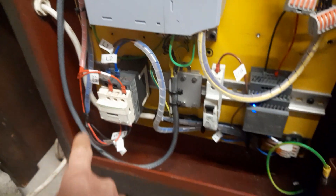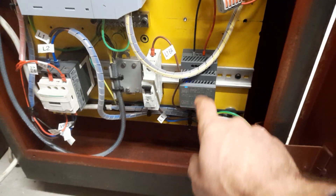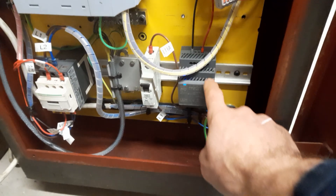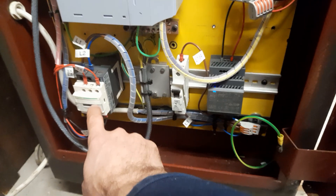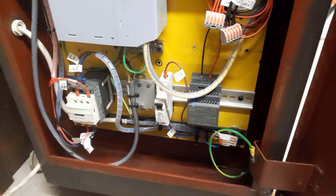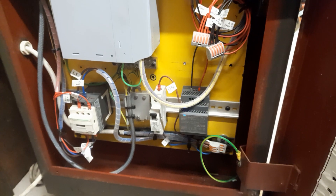The power just comes from a standard 13-amp plug — I've never blown the fuse. That power comes in on the white cable. I split that power because I've got a 24-volt power supply, and a 13-amp fuse is not suitable protection for the wiring to that supply, so I go through a smaller MCB. That powers the 24-volt supply, which is used for enabling the coil on the contactor and also the work light up on the top. Prolific use of WAGO blocks.